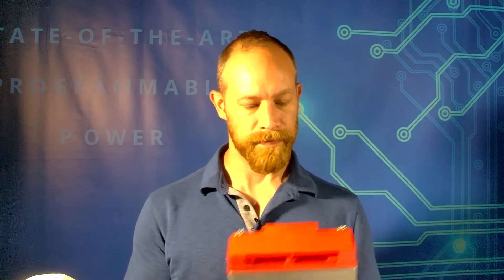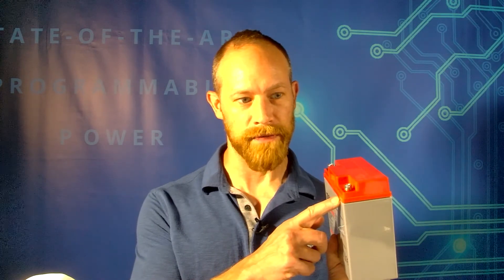So if your power supply is set at 10 volts and you're connected to a battery — if the power supply is at 10 volts and the battery terminal voltage is 12 volts, the battery is going to push current right through that power supply and effectively discharge the battery. If the opposite is true and we program the power supply for 12 volts but the battery terminal is 10 volts, the power supply is going to automatically start to charge the battery. That's true whether the output is a battery or some type of load that can also push current in two directions.